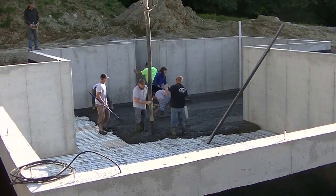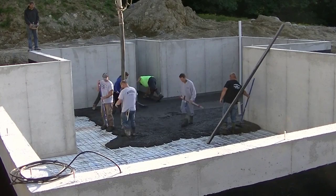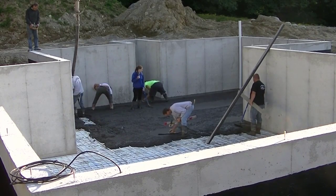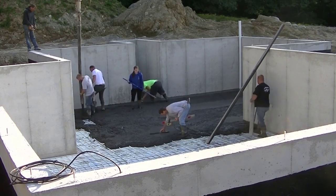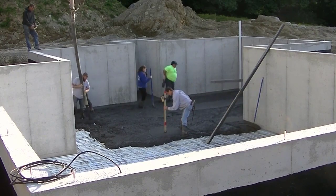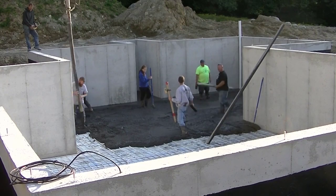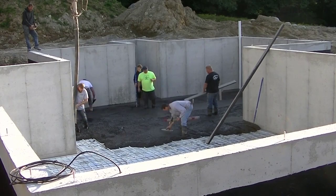You can see Darren's got the end of the hose, dumping the concrete out. We've got a guy behind him puddling the concrete and raking it as level as he can, and a couple guys magging edges. I'm making wet pads using my laser — shooting a wet pad — and we're going to screed off those wet pads. We also screed off the pads the guys are magging around the edges. They're magging those pads to a chalk line; we shot grade with a laser and snapped the chalk line all the way around the perimeter.